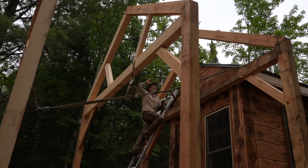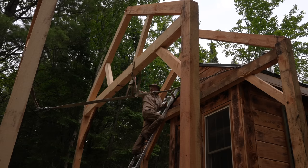All my wood strapping is cut 2x6x10 feet long, which is not enough to span from an overhang here to the third truss. So I have to piece it in, like one to here and then one to there. So I'm going to do that every second one and then mill some longer 15 footers so that I can span three. In other words, I do an overhang here 2x6 to the center of this frame here, and then from there I'll go all the way out to the overhang on the outside of the kitchen, so that's spanning three, and then I'll alternate that, so short, long, short, long, do the same all the way down on both sides. That'll give it a lot more structure,